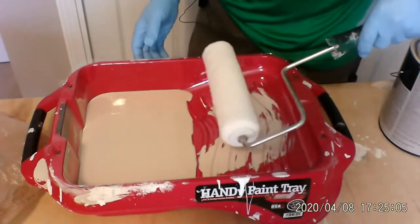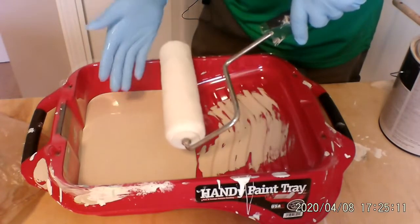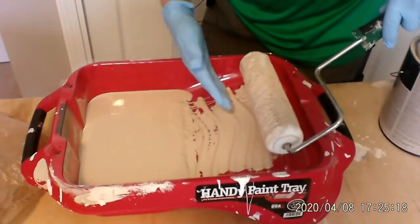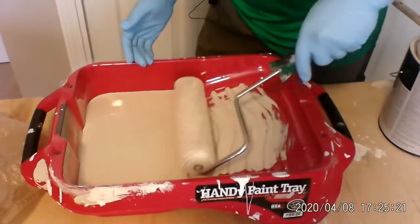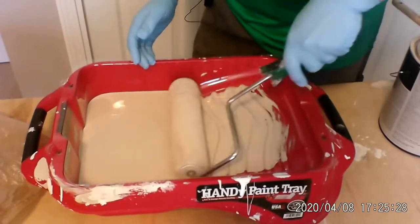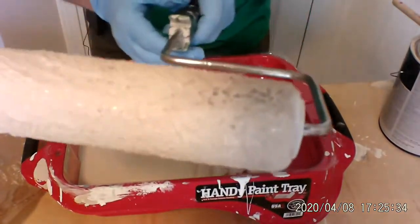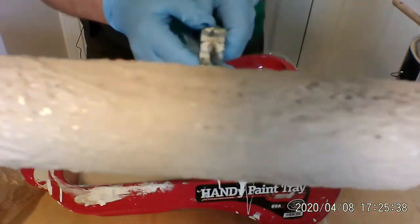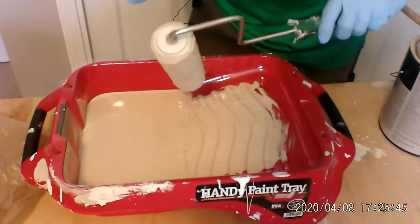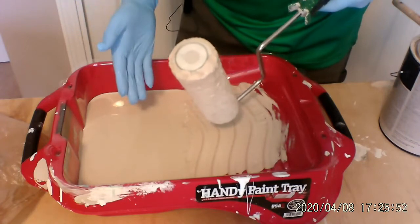You're not going to submerge into the existing paint in the pan. You're going to take a little bit at a time, just like this — get it up onto this angle up here, and it kind of pushes it off the roller. You push a little pressure down on it; it forces paint into the roller itself, and you can start painting. I don't have a bunch of paint on there — you don't need a bunch of paint. Just nice and gentle, not a big deal. Don't submerge it. Here's your clue: try not to get paint on the metal parts here — if you've done that, you've gone too far into the paint.